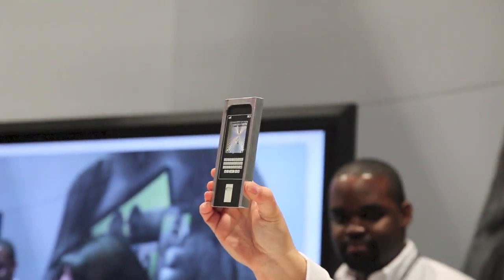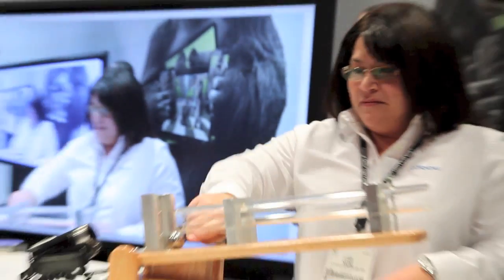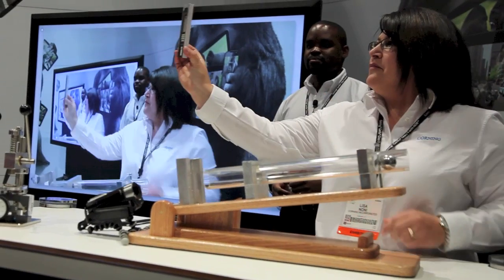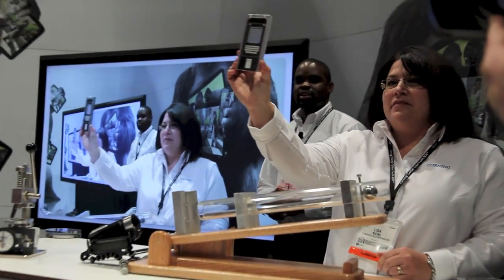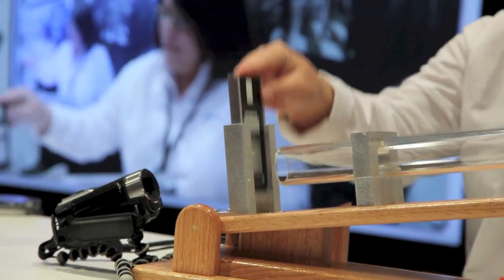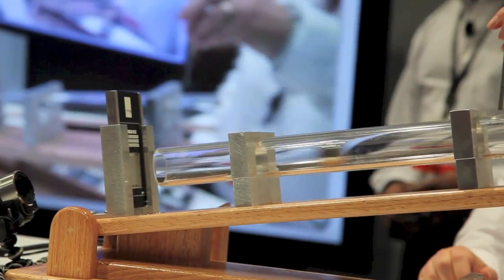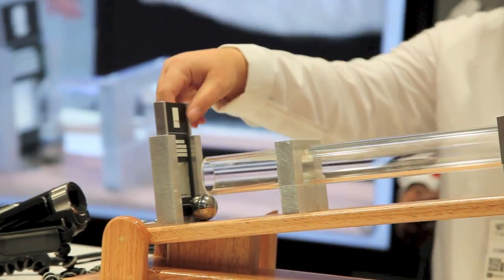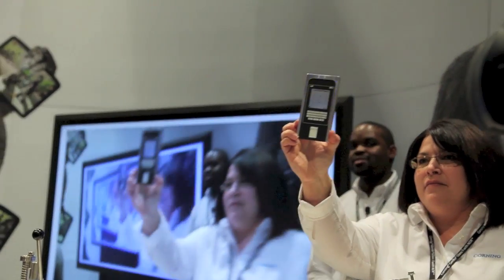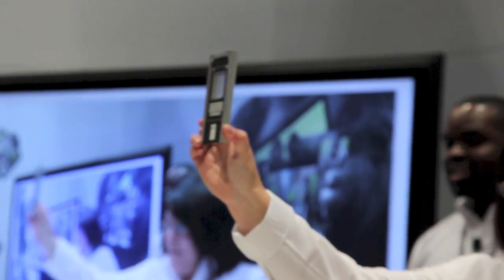I should mention that's a ten degree incline. Now she's going to put a piece of Gorilla Glass 3 with the same seven newton scratch, at the same thickness of 0.7 millimeters, into the same test fixture. And there you go — there is no break on that glass. There's still that seven newton scratch, but the glass did not break.